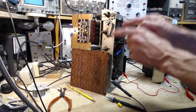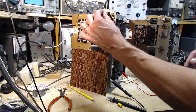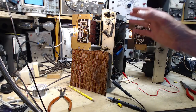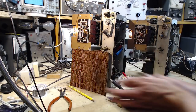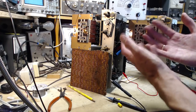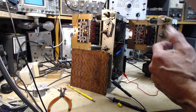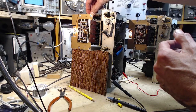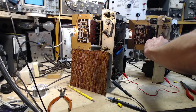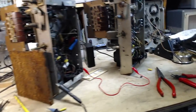This might be the local oscillator from this radio. Listening to this one. Yeah. So you can tell from the scratchiness, as I tune this radio, it can be heard in this radio. That tells me that the scratchiness is probably from the local oscillator jumping around. And I'm sure it's all from the same thing. Probably a dirty shaft here. Easy to fix when the time comes. Okay. Well, they sure seem similar. And I guess they should.